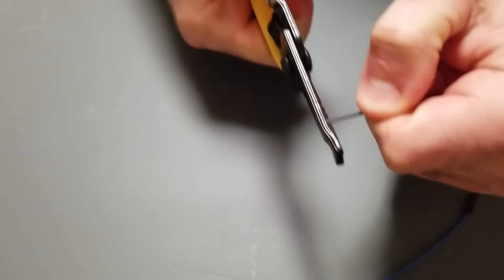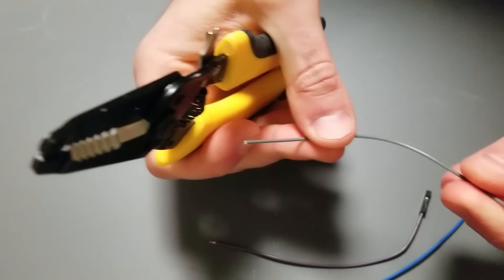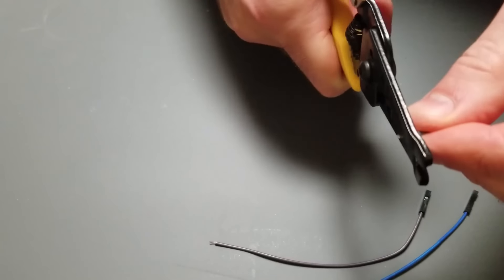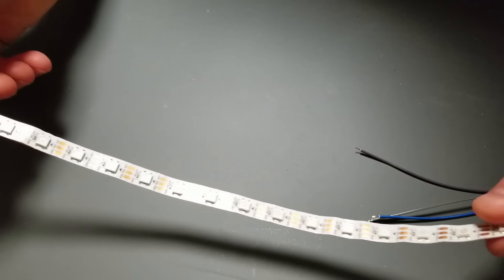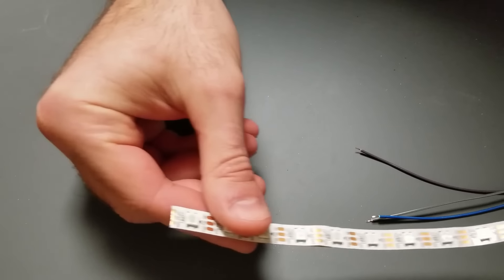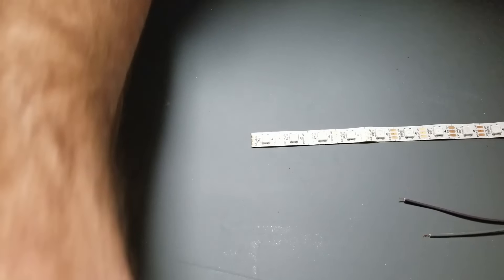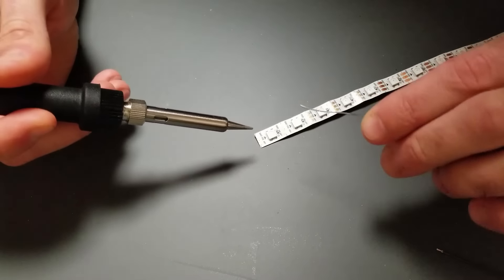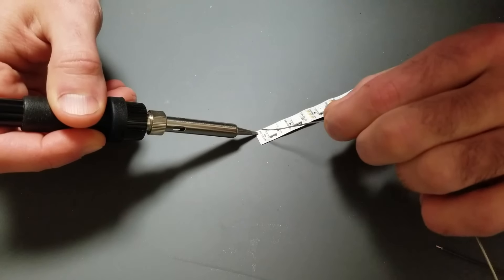Back to the project — I'm cutting one end of a jumper wire off and then using a wire stripper to expose a little bit of the wire. This exposed wire is what I'll be soldering to the LED strip, and the other end can easily plug right into the controller. You're going to want to cut your LED strip to about 12 inches, or however long it takes to cover one edge of the acrylic design. For me, 12 inches meant about 17 LEDs, but this could vary depending on what LED strip you're using.